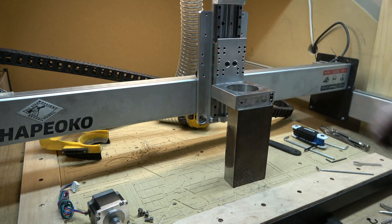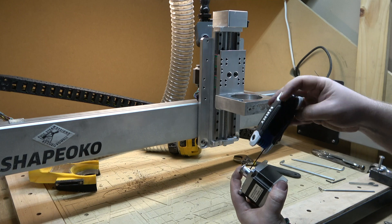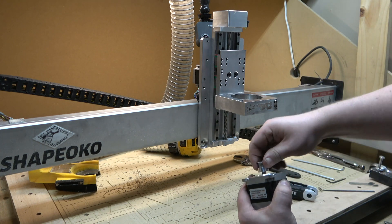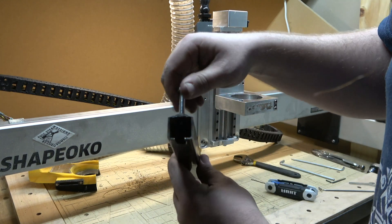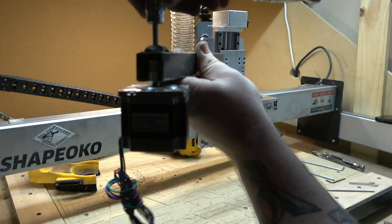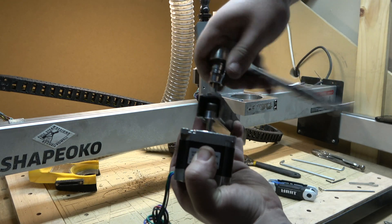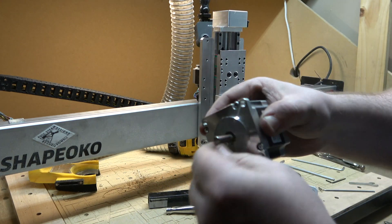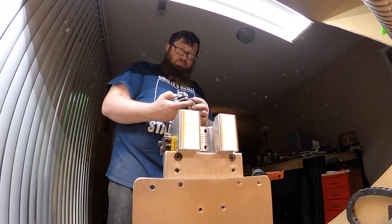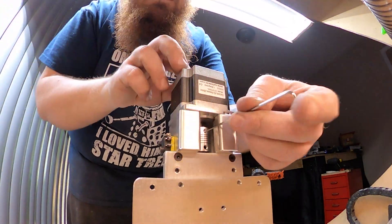Now we've got to get this pulley off the motor. You wouldn't think it would be too hard — get these two screws off and you might think it would just come right out, but these are stuck on there pretty good. There's a little bit of adhesive like Loctite that they use on them. I ended up making my own tool; if you don't want to do that you can just buy a pulley remover — I'll put a link in the description. Don't try to smash this off with a hammer; I've seen people put them in vices and crush them because it's aluminum, but you really want to be careful of that shaft. I'm just getting that excess Loctite off because it was having a hard time going into the connector at the top.